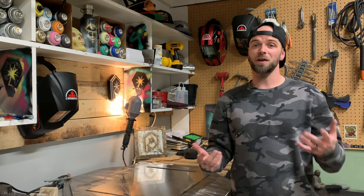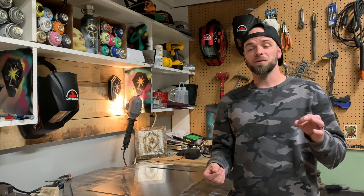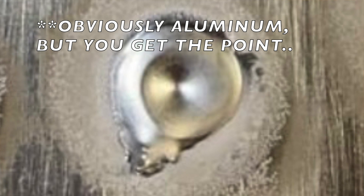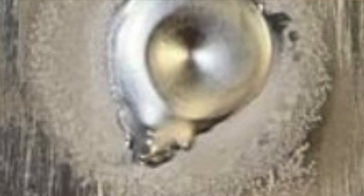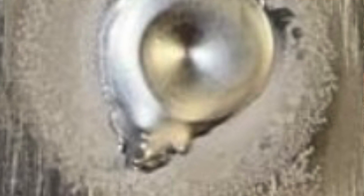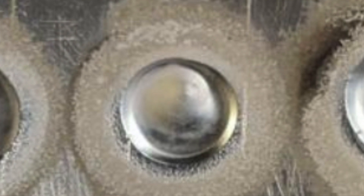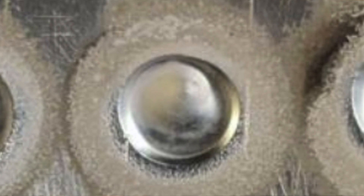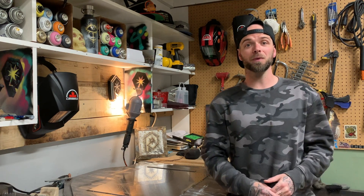Another thing that's pretty common — I call it drag out. This should be a round dot; this is an exercise we do in my online training program. This is a student who was having problems with a bad filler rod angle. You can see on the bottom edge there's a little drag out where the filler rod has been dragged out of the puddle because it was not put in with a proper filler rod angle. This is a proper example where he corrected it — all of a sudden we have a round shape again and we don't see that drag out. That's why filler rod angle is really important.